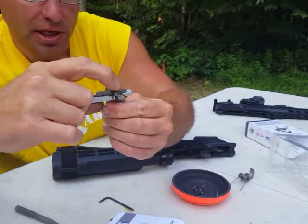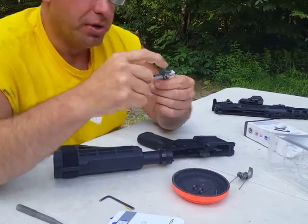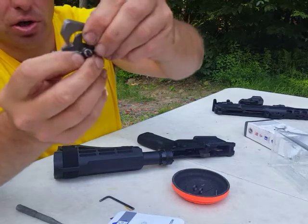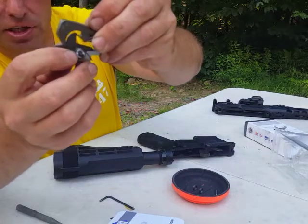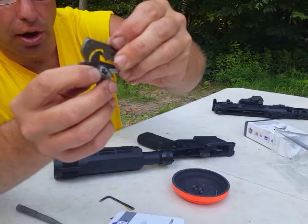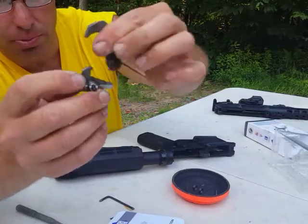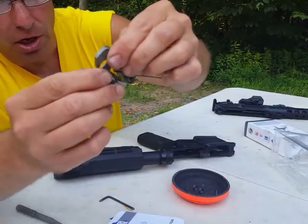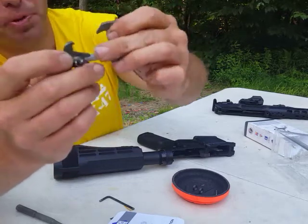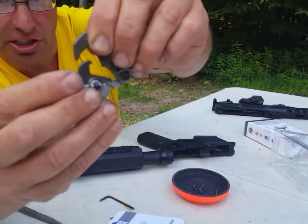That's the thing that basically, if you're holding the trigger down, this little thing over here is what catches up here and prevents you from firing the gun until the bolt has fully closed. So it basically also keeps it from going full auto, right? So that's the disconnector, where this piece catches onto this piece. Once you let it go, this piece over here catches to that piece right there. So that's where it normally sits. That's your sear right there.